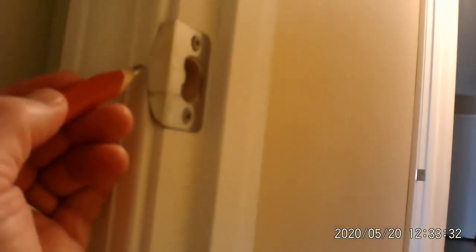I'm going to show you a trick on how to make the door physically close properly. First, I figured out the center part of this strike plate. The door post that goes into here should basically line up inside of this oval. So here's the center part right there — I put a little dash right there. Then when I close the door, you can see the strike plate is up here, and this barrel here is not really centered. So I'm going to put a dash right in the center of where that barrel is, and that'll give me an idea of how far off we are. We're not too far off.